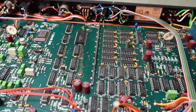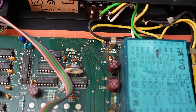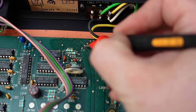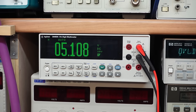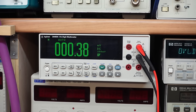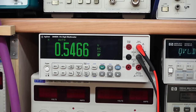After you're done twiddling and mixing signals together, the output comes to this chip here - the DAC80 - which converts it back to analogue. With any electronic fault finding, the power supply is the place to start despite that red light coming on. There's a very convenient place to measure all the voltages together. We've got plus 12 - nothing there - plus 5 is working at 5.1 volts. That other rail is unlabelled with nothing on it, and we've got minus 5 - also dead.